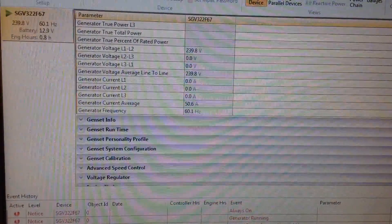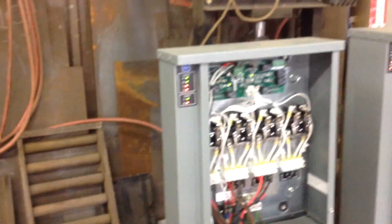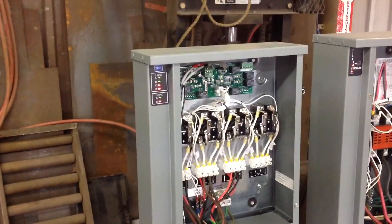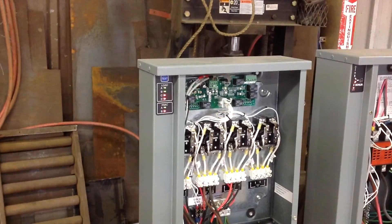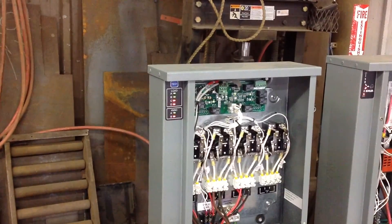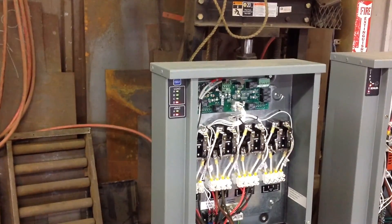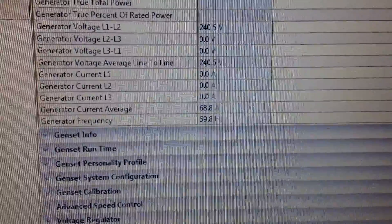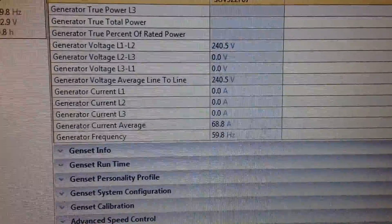What I just did was turn off the oven, simulating you're done making dinner. That took the amps down to 50. Now there's room on the system, so it should be adding C back — which was our dryer. Skipping forward about a minute in film — C is pulling in right now. Since we're done making dinner, the oven's turned off, the dryer's back on, running at about 68 amps, and you are able to finish your laundry.